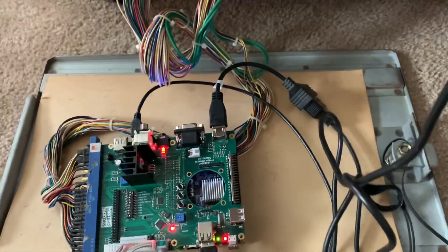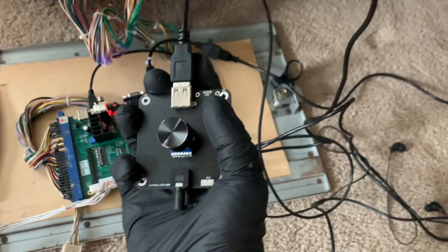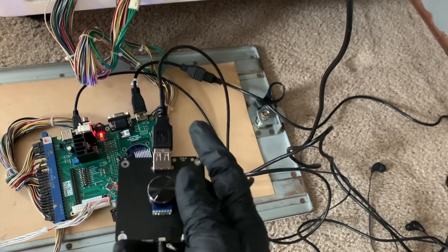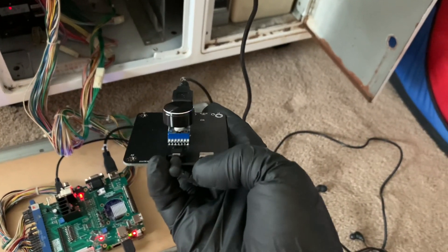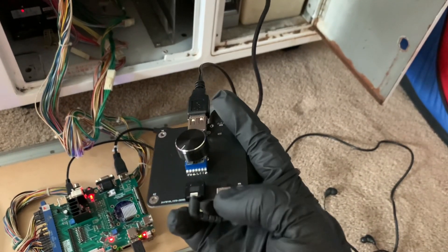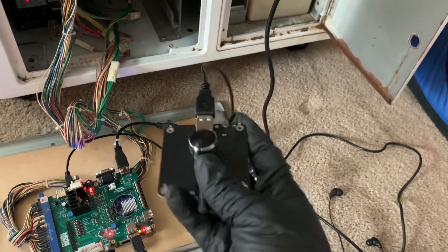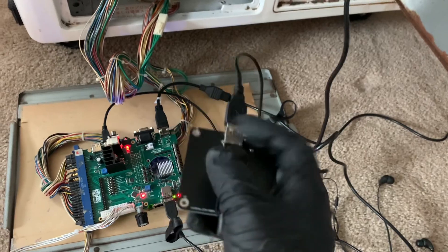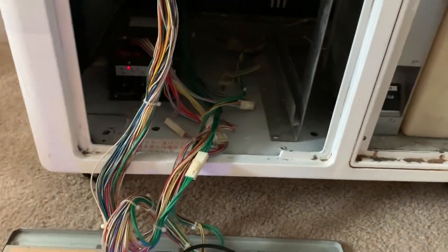This mini USB cable is connected to a board which is simply passing line-level audio for left and right channels, as well as an amp cutoff signal, and has a little volume knob. The idea is you take this USB cable, plug it in, fish it out of your cabinet somehow — you can have it sitting on your control panel top — and then plug in headphones if you want to play without disturbing others. You can control the amplified audio going to speakers, turn it on or off with this switch, and use the volume knob for headphones. It's not recommended to leave this plugged in while audio is coming out of the speakers because you're splitting current between this and the audio amplifier. In terms of audio, you really just have this one volume knob adjustment, plus per-core audio and your audio in the OSD.